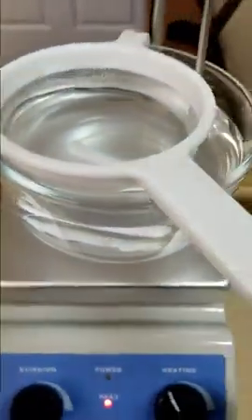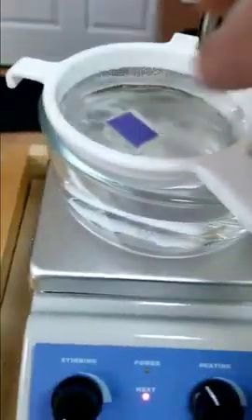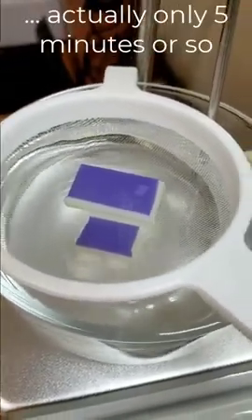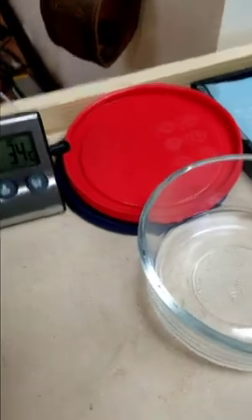Once you have that set up, when the pieces come out of the printer they'll be blue with white material on them — the white material is the support that's going to be dissolved. You put them in the warm alcohol and stir it, not super fast, just enough to get it turning. This process really doesn't take long — maybe 10 to 15 minutes or so. Once they're clean, be very careful taking them out with tweezers, then place them in the cold alcohol and let them sit for another five minutes.